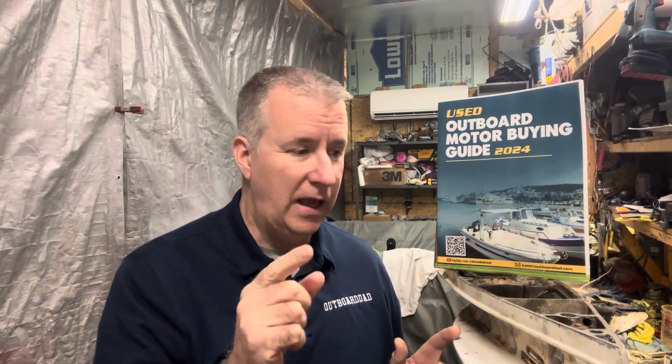So tomorrow we'll get up there, we'll record the session, we'll meet Mark up at the marina, check out his place, see what he's got going on up there. These are the guys I've met over the years and been able to work with who've shared knowledge with me. This lower unit I'm doing a video on now that I'm rebuilding, just waiting for the parts to come in. And a gentleman said to me in a comment, hey, you know why that extra bolt is in there? I had said, oh, why do they put all these bolts in here? There's 2 right next to each other. He says, oh, that's actually a stabilizer bolt, because they found that they vibrate a little bit there, and if they put that extra bolt in, they have less challenges. So I said, is that in any manual? Is that in anything? He said, no, I learned it when I was at MMI.